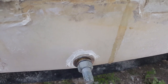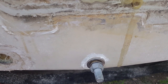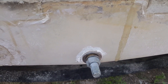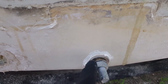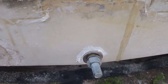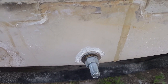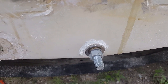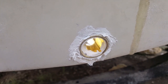You can see it actually started to flare. Give it a firm tighten — not too crazy, because if you do too much you'll split it, but give it a good solid turn. That's about what we're looking for. Go ahead and loosen this and see if the flare looks good. Note: if when you go to remove the nut the whole flare spins, you probably don't have it tight enough — put another firm turn on it.